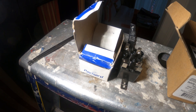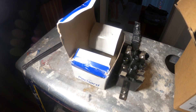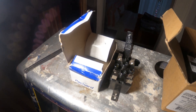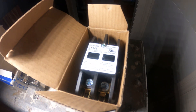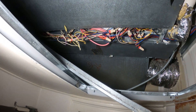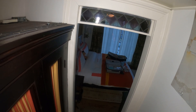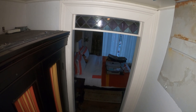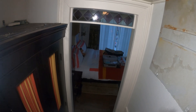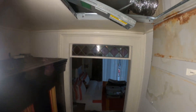Or I think during that previous call there might have been a grounding problem — like I didn't have a neutral, so the circuit wasn't completing. I'm going to try that relay. But if not, I have a contactor. The thing is, this is a 110-volt coil — not really the common thing. But worst comes to worst, just to give them heating for tonight, I would install this contactor and come back to put in the proper part. I caught them right at the right time because they were packing up to move to the next room. I can understand the frustration, but I'm going to have them up and running real soon.